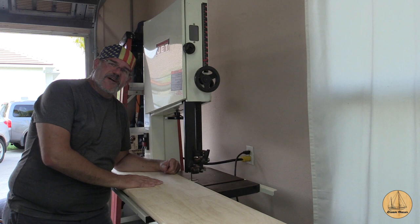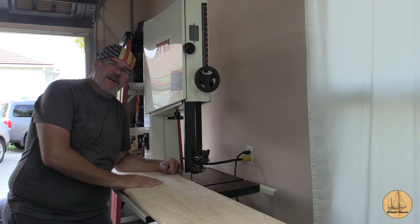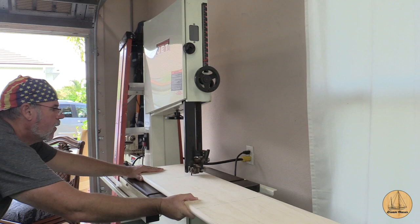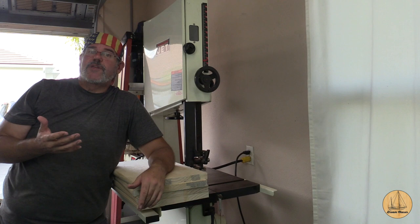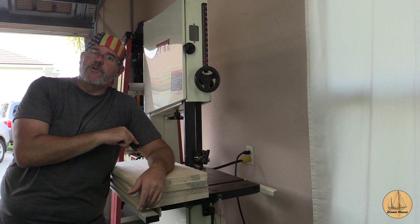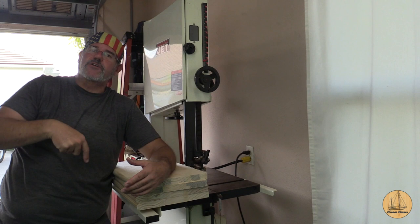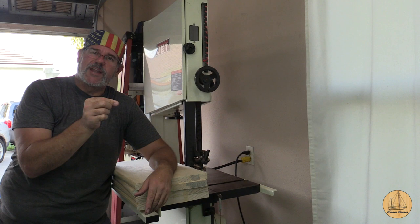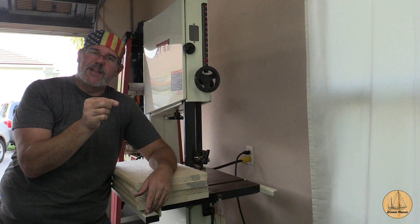It's been a little while since I got to use my bandsaw, and it's kind of fun to be able to. I'm going to cut the tops of each step on the bandsaw. One thing I probably could have done to make this better is put the wider blade on for cross-cutting or ripping wood. This one's a real thin blade for doing scroll work and intricate circles and curves. I like to do work on a wood lathe, so I have it set up mainly for cutting halves or quarters of logs in a big circle to make large wooden bowls. That's good for curves, but it's not great for running a long straight cut — the blade will twist just a little bit as you go through it, and once it starts going at an angle it's hard to recover.